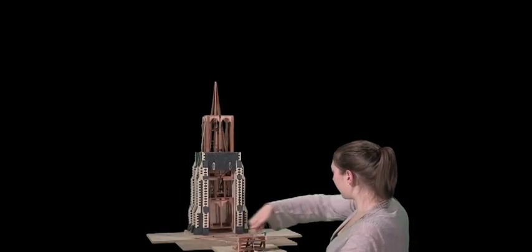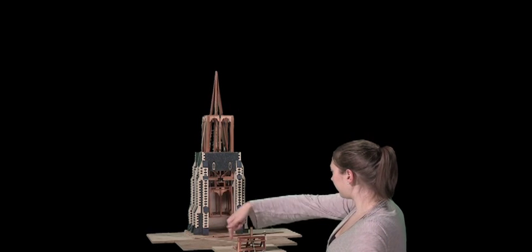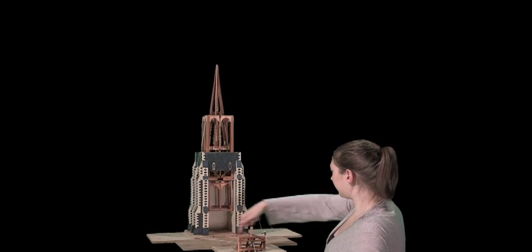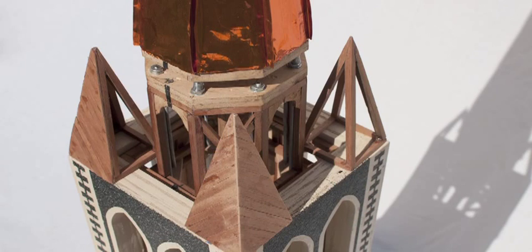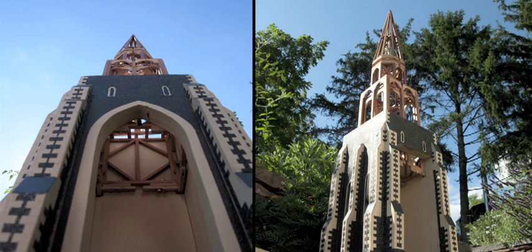At this point, the parts for the spire and upper section are assembled in sequence, then raised up to allow the next section to be assembled. At the same time the sections are being assembled below, the roofers can be busy sheathing and cladding the spire and setting the cross. Subject to New Zealand's safety codes, netting and careful walling off could allow two crews to work above one another. With some planning, the frames that hold the ring of bells could be fabricated and installed to the upper section prior to it being sent aloft.